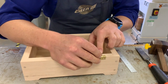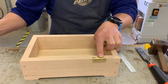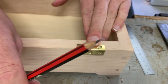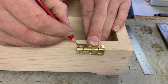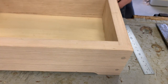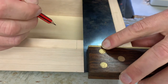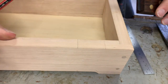Now all I need to do is you can measure out your mark, your distance of your hinge. What sometimes is good is just to line that up with your pencil on there and to mark that out. Pencil mark there. I need to have a nice sharp pencil so my lines are nice and crisp. Then I'm just going to mark that other side just there. Putting my pencil on that mark there and across, and the same over here as well — putting on the pencil mark and then putting a line across.